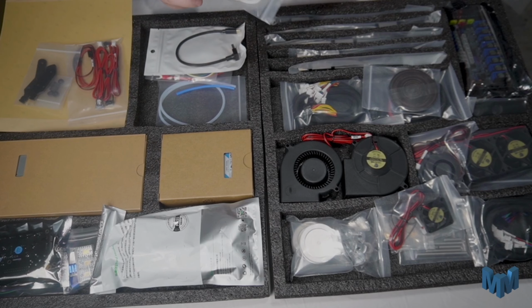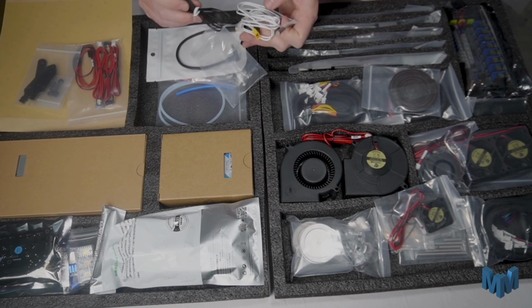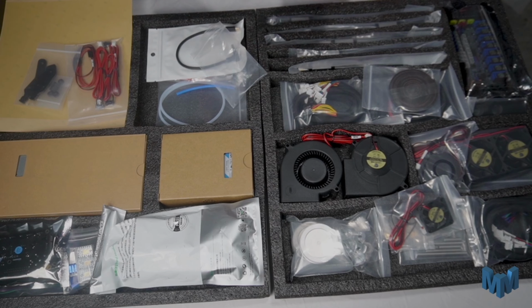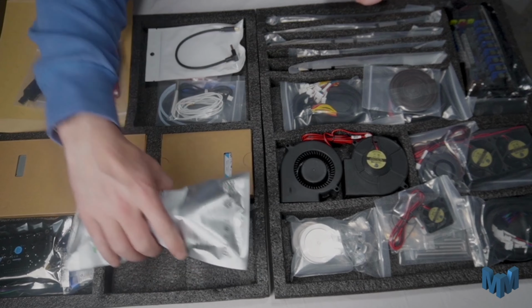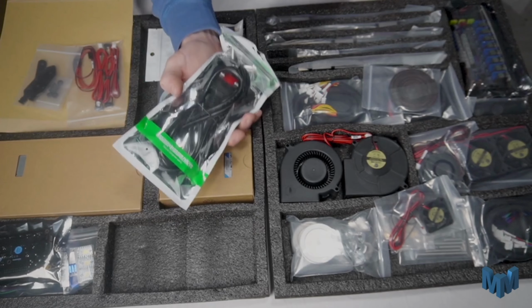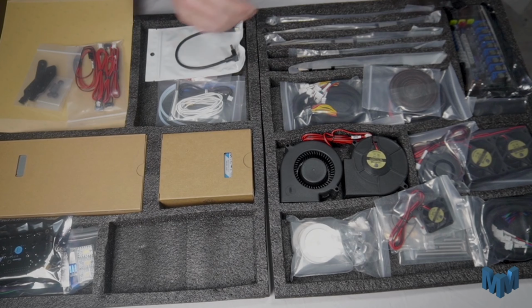That appears to be the heater. This appears to be the hot end heater and thermistor. It's a cartridge style thermistor with a nice braided cable, and the heater cartridge is a 70 watt heater cartridge. That's quite substantial. And we have some Bowden tubes under there. There's a boring, we're not going to open them. Power cable, 3-pin UK for me. That side.